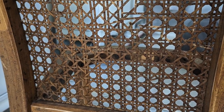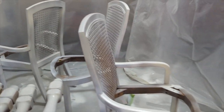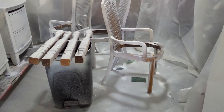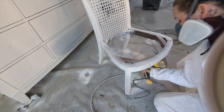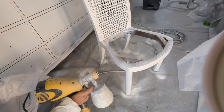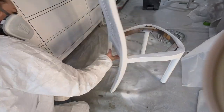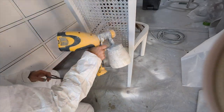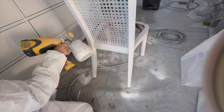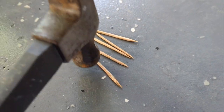Now the other challenge was that one of the chairs was in really poor shape with the caning, but first I primed them all with a shellac-based primer. It is shellac-based, which means cleanup is with ammonia or denatured alcohol. Do not be scared of this primer — I have a $75 gun that I use, I keep the primer in it all the time. You can find out how I do that on my Instagram. I prime and you get no bleed through with shellac, and that's why I use it.